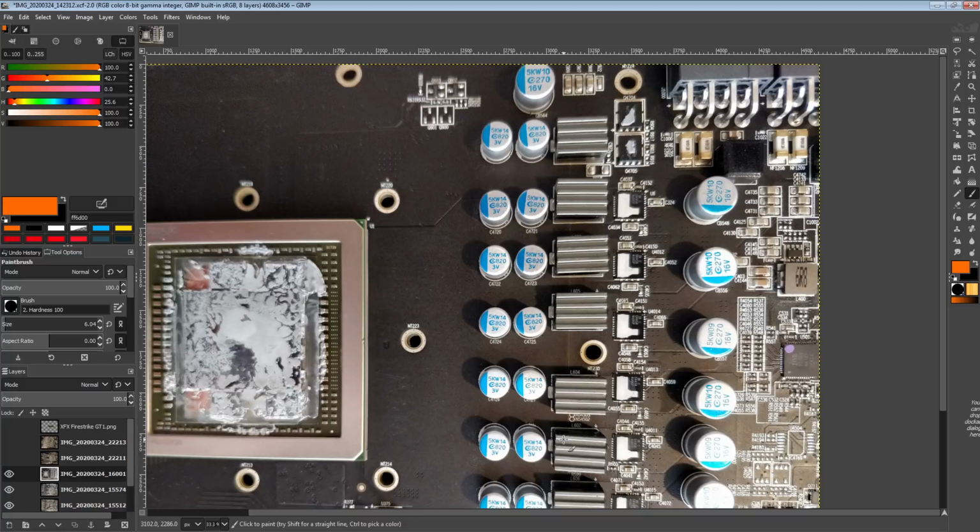But at the same time, that can get very expensive, because eventually you start running into concerns like how much time it spends on the pick and place machine. If you have a card with a couple hundred more capacitors than everything else, that's potentially going to start slowing down the production line whenever you're trying to produce those.